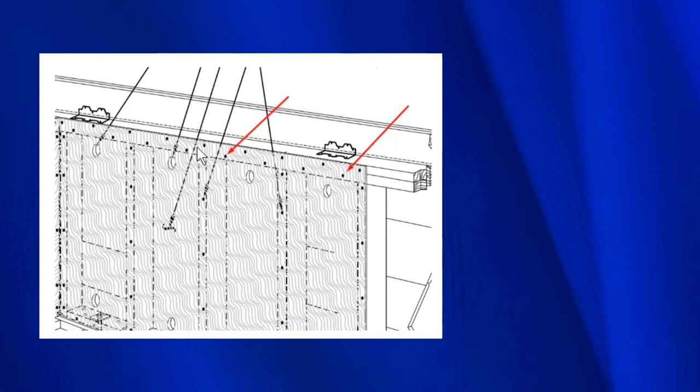When the plywood pushes on top, the bottom also pushes into the bolts. The nails in the lower top plate are not connected to the shear transfer tie — therefore they are not doing anything.